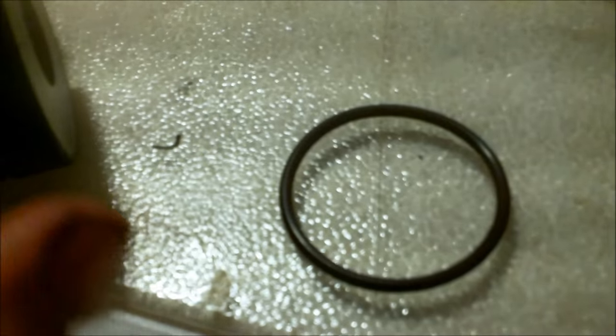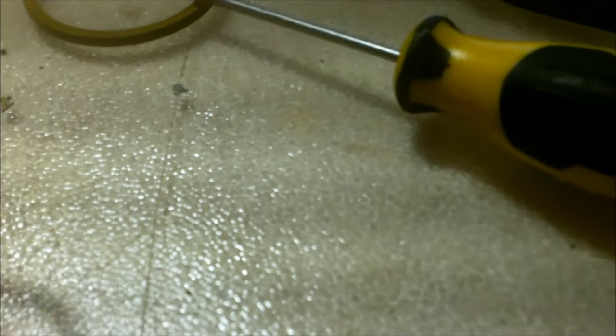Next is this giant o-ring. Then I put my flat washer against here and then my brown o-ring — which could be black depending on your kit. This part's done. We only got a couple more washers. This piece is like the stopper on the end of the shaft — it's a neoprene or nylon washer and doesn't have a lot of flex to it. We've got a replacement one for that, and underneath it is an o-ring that we have too. We'll take our hook tool, bend it up — it's okay if we break the old one. Now we'll put the new o-ring in, sit it on here, poke it down, and roll it around the edge with your fingers. Then I would heat this up just a tad and stretch it carefully to get the washer in there.